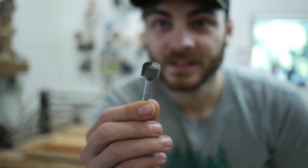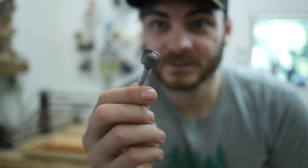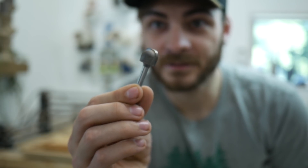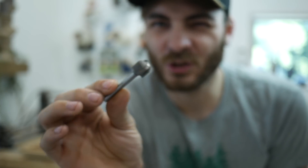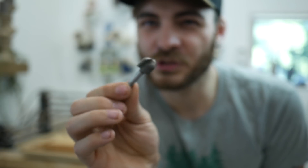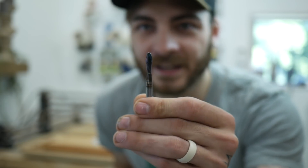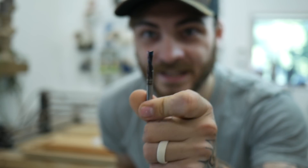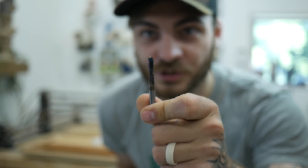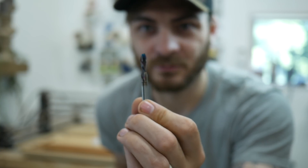The first bit I use to cut the juice grooves is a three-quarter inch dish bit, or bowl bit — whatever you want to call it. You could also use a cove bit; a half inch would work just fine. The three-quarter inch is a little big for the juice groove. The second bit I use for cutting out the cutting boards in a weird shape is this quarter inch down cut. A quarter inch up cut will work just fine too, but the quarter inch down cut doesn't shred the tape or mask, which I use a lot.